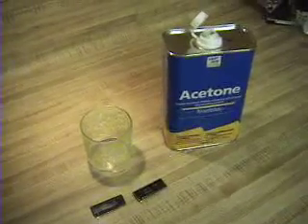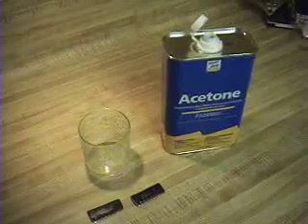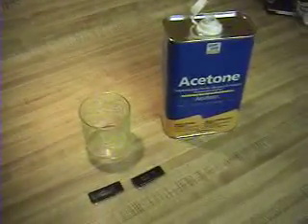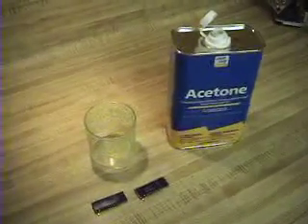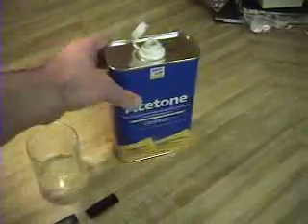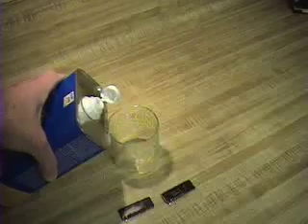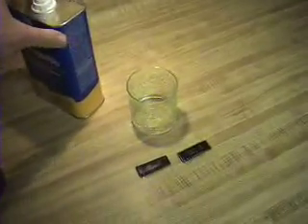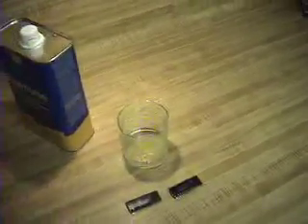Once you've removed it all, what I have found is that the chips seem to recover quite well. The two series chips I have are 817A, lot number 44A, and the other one is an 8170, lot number 41B. So the trick is I'm going to pour some acetone into this little glass cup, just enough to cover both chips.